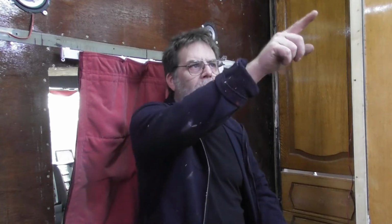The question is, where do we put the levers? I'll probably end up having to build a box on the wall somewhere with a door to hide them because they're ugly. Let's be honest about it, guys, they're ugly. But if it makes this work more efficiently, then I think that's the answer. And then the other problem we've got is the hydraulic rams themselves. We're going too fast. I have now picked up some more rams that have got a bigger diameter tubing.